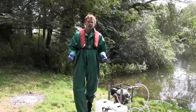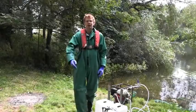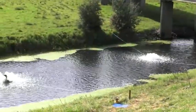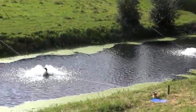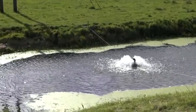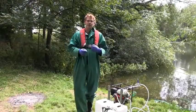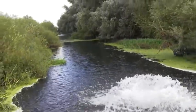There are a couple of ways we use mechanical aeration to raise oxygen levels in lakes, rivers, or drains — wherever it's needed. Bubble aerators are often sunk to the bottom of the lake or river. A simple pump pushes air down through pipes into the diffuser at the bottom, pumping air up through the water, which helps displace the surface, create a larger surface area, and allows oxygen from the air to naturally diffuse into the water.